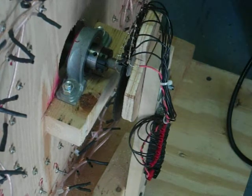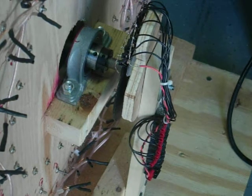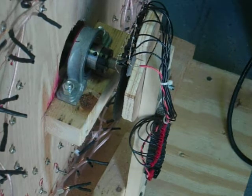And now I've got to do a PC board with a couple of FETs on it just to do a test with 12 volts and see what happens. If I ping the coils with 12 volts, just touching it, the lower ohmage coils give me about 14 inches of rotation from a single little tiny touch, and the higher ohmage coils give me about 6 inches of rotation. That's per touch. So you can imagine that at say 500 volts, this thing should scream.